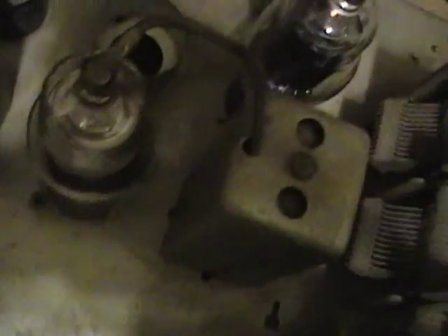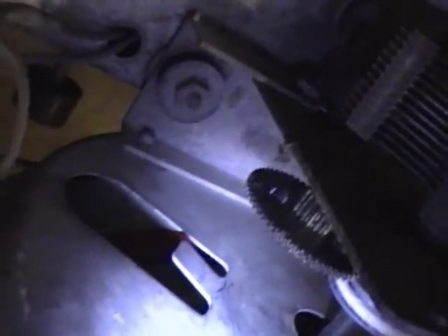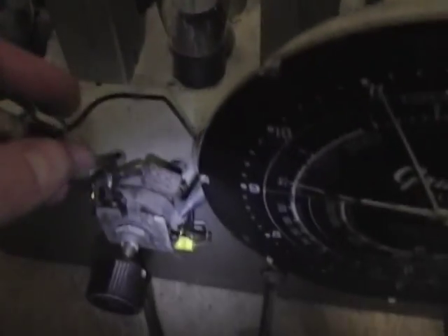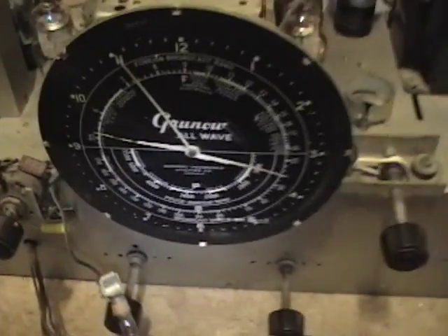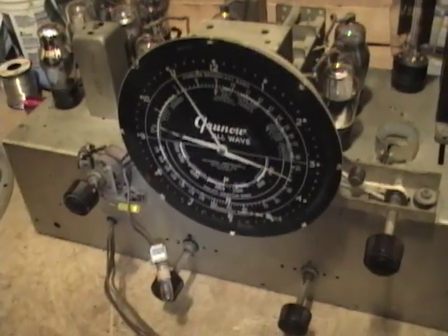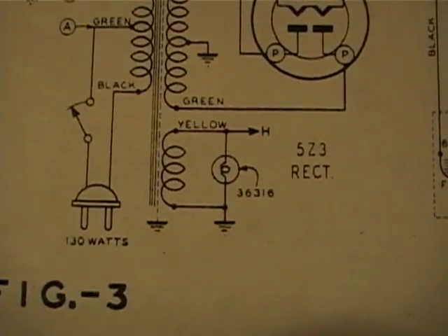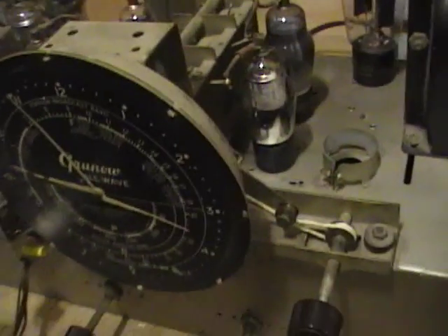There's a tab back there, and that corresponds to this slot, so this one's supposed to slide into that. I'm going to see if I can find a replacement bulb and try getting that going — at least we can get some illumination on the subject. The schematic doesn't state what kind of bulb it should be, just a part number. I just dug through my assortment of bulbs, and the only threaded bulb I had is a number 46, so I'll put one in and see what happens.